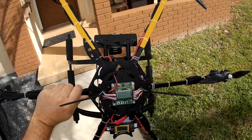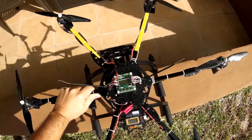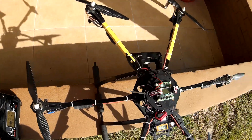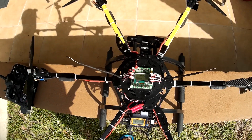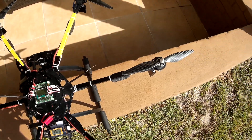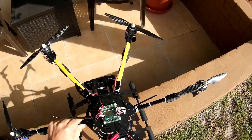I'm going to share all my settings for you. My board says 11.7 and this guy says 11.1, so this is obviously a little more detailed than the onboard. The onboard never went off, so obviously what I need to do on the onboard is lower the warning voltage so that way it goes off sooner. This is my X700 — I think it's ATG, the frame I'm using. The board on here, again, is the Hobby King KK 2.15 with patch 1.6. It came factory 1.6 — I didn't patch it myself. Battery on here is a 3-cell 11.1-volt 6,600 milliamp. It works very well with this — it's balanced very well and it fits perfect.